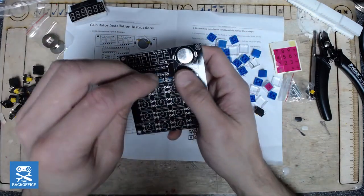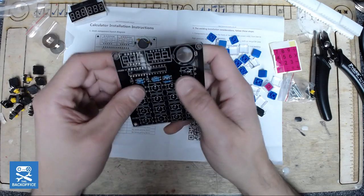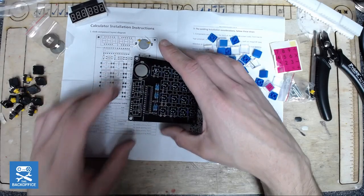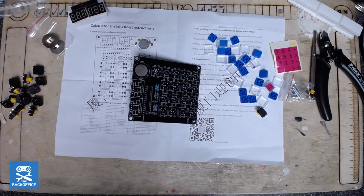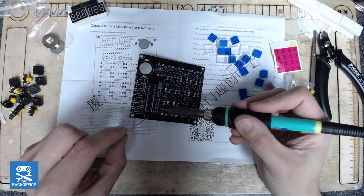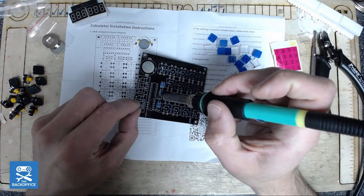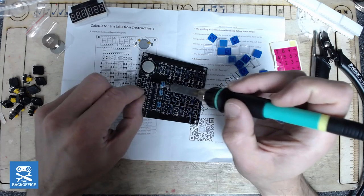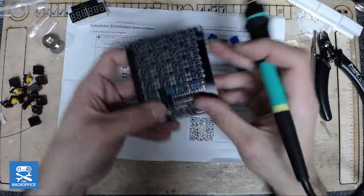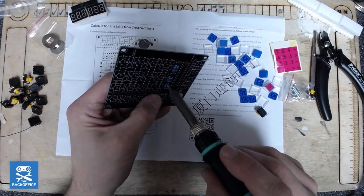So Yoshi, do you still have those booby boards? I think they were programmed up though. You could still use them right away for doing some general GPIO. Not that there's probably much you'd want to use them for, but if you did buy a PICkit 3 programmer, you should get in there and sort that tool chain out. I think quite a few people have, and you can see how quickly, like the other day when I decided I wanted to make a servo interface, I just jumped in, programmed up the C, and it worked. You don't really have to play around with anything. I know if you're into Arduinos, you can use those for that too. They might be better if you're more the hobbyist sort. The reason I like to prototype on something that resembles the final hardware is that then I don't have to design out the bloody Arduino.